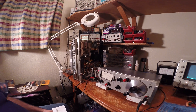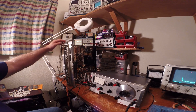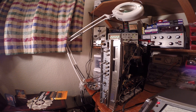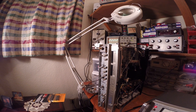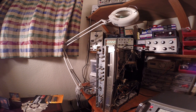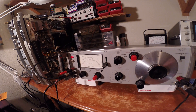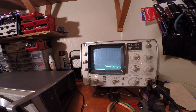What we're going to do here is distortion measurements on Dave Garman's Marantz 2238B. This unit has just been repaired, and we're going to check it for distortion and see how it holds up. The distortion rating on it is 0.08% total harmonic distortion, and that's what we're going to measure. We have a distortion analyzer right here — it's a Hewlett-Packard 333 — and over here we have a spectrum analyzer. If there's distortion, we'll be able to see it on the spectrum analyzer.